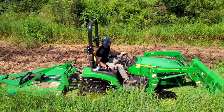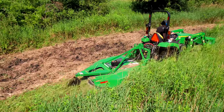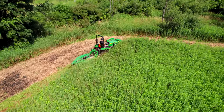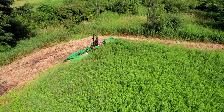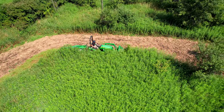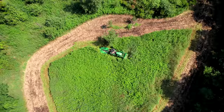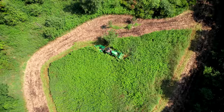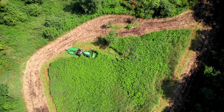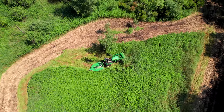In today's example, this is very tall, thick, wet material. It's not that you can't tackle it, but it requires a different mindset — compared to an open dry field you've mowed once or twice already this year, where you can cut at a lower height and faster speed. So let your circumstances dictate how you're going to mow. In this case, I'm probably going to mow a little higher. You can mow even a foot higher if needed and make a second pass to get that initial cut down, then take a secondary pass to really chop everything up.